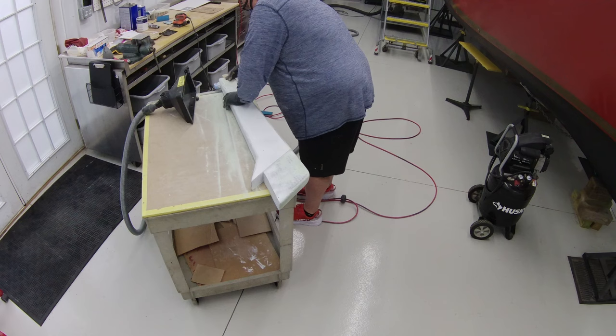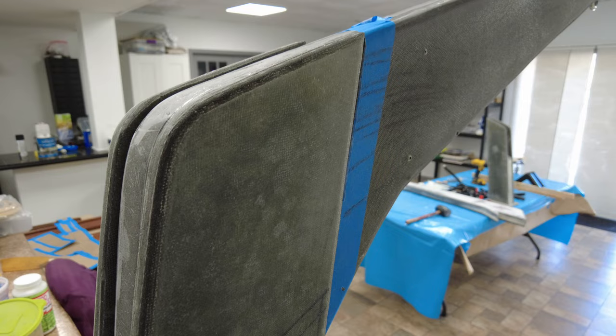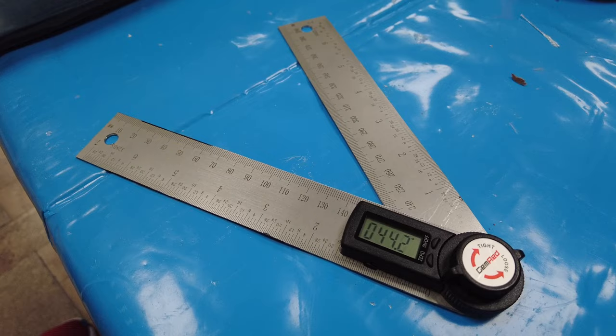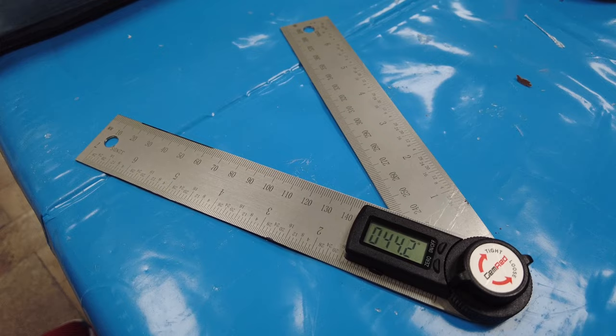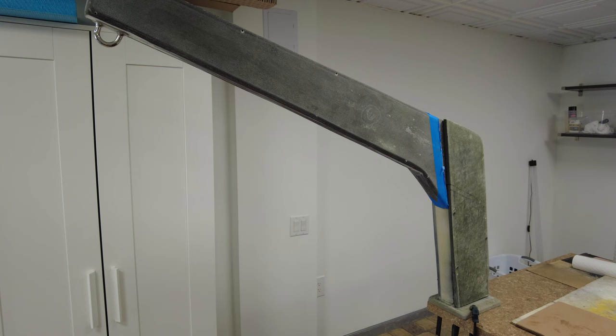The only solution is to make the arms thinner by about one or two sixteenths — sanding seems like the way to do this since it's such a small amount of material. And that's not the only issue: once everything fits inside the slot, it's a matter of getting the perfect angle so the upper arm rests fully on the lower arm. There's only one way to do that — it's time for a new tool. We call this one der Winkel — das ist der Winkel — a digital angle finder. With high accuracy it tells us exactly how much the angles are off so I can carefully sand off just enough material.